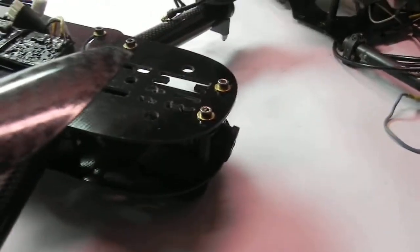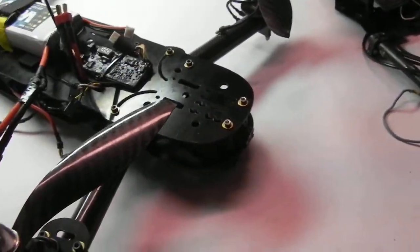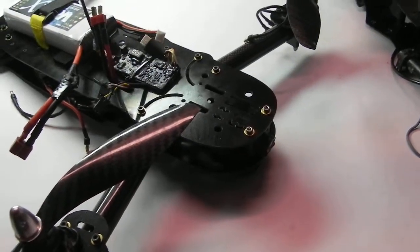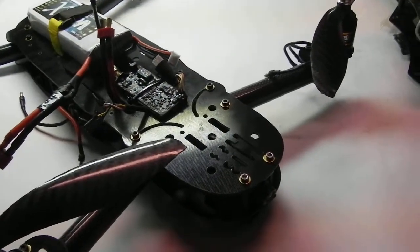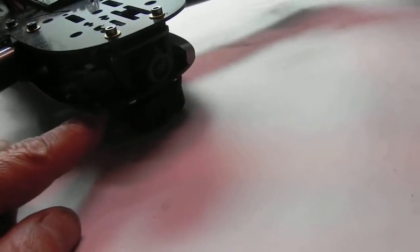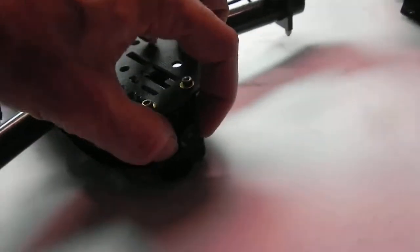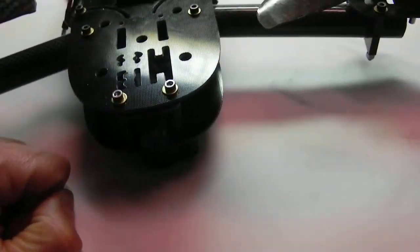They'll be far clear of the front of the lens, and even on other quadcopters you'll see props in the picture. But if you were to fly 4-cell with 8-inch props or 9-inch props even, you would have zero picture interference, probably zero shade interference of the actual propellers too, because you can recess your camera underneath the HB8's front so that it's shielded by the light and the sun a bit. And then the FPV cameras here, which I'll look forward to flying with, right on the front.